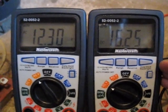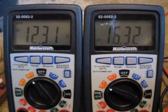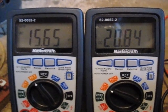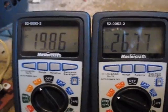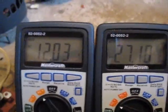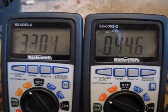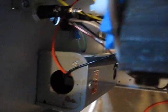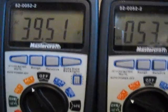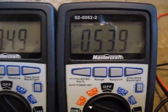I don't know why, but as I increase the voltage the DC tends to want to go higher than the AC. If anyone has a theory on why that is, I'd love to hear it. We're already getting a few volts difference on the DC side. That's 10 on this one, so I go to the next switch up and it continues on. You can hear the humming of the upper transformer a little bit. It's almost 40 volts AC, 53.9 volts DC.